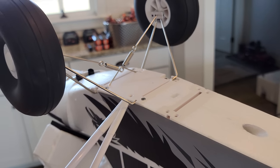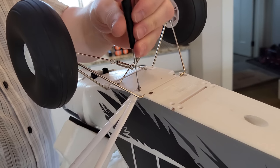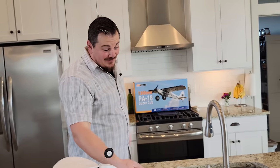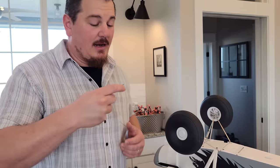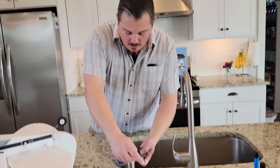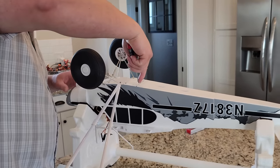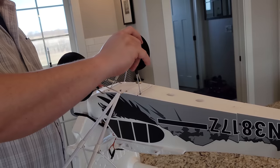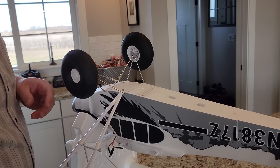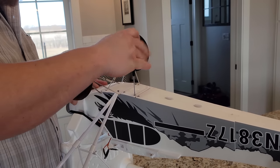So that's now tight. There's going to be a lot of screws on this. Should we pause while we're screwing this? Let's dip the tip in some Dawn dish detergent because they are kind of not going very smooth. Guys, if you haven't ever done this, it does really work nicely — if you put a little Dawn dish detergent, or take a bar of soap, you can lubricate the threads nicely. So if you're having trouble getting those things to start or go all the way in, you can do that. Now, if you use an impact, you will break a nut insert — I promise you will.